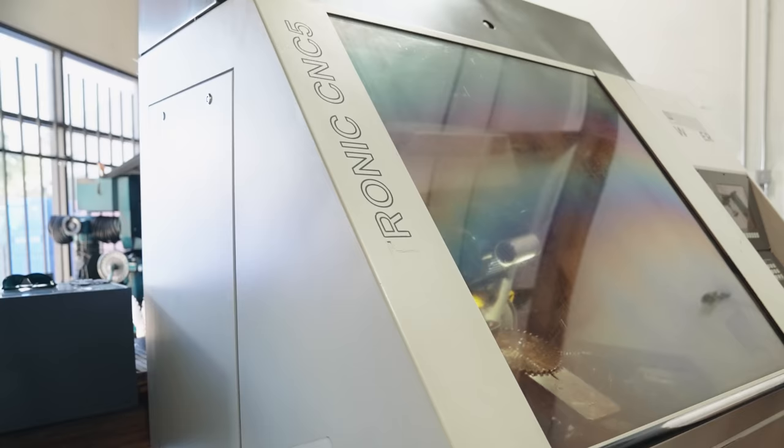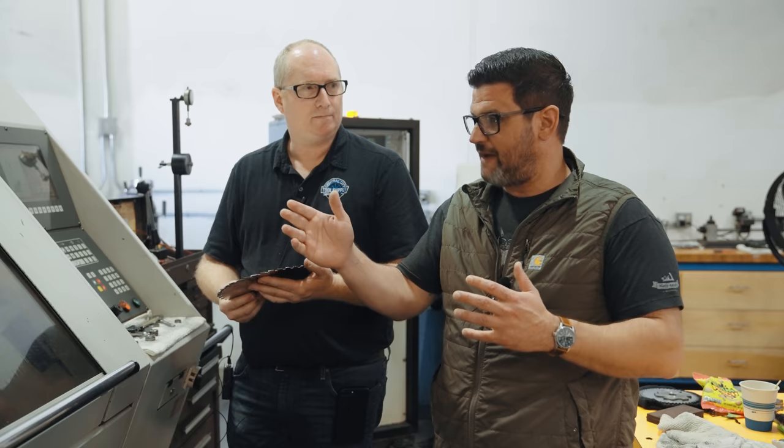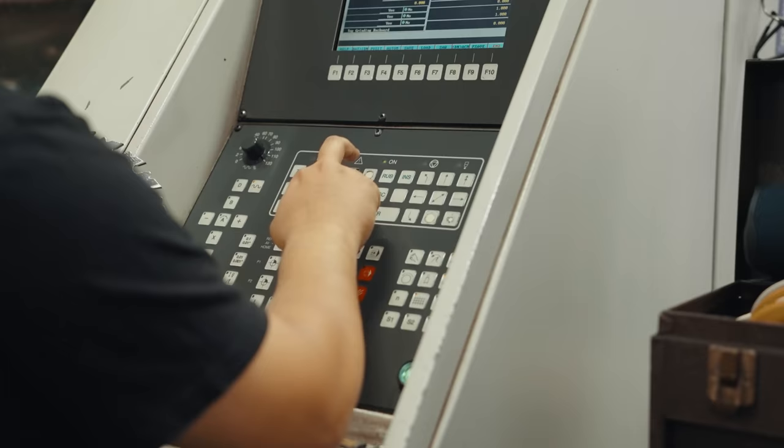Next, we're actually going to sharpen the blade. Mike has one of the coolest machines I think I've ever seen. What is it? A five-axis CNC saw grinder, programmable to rake angle and tooth angle. Not only that, but it can probe the distance between the teeth. And if there's an alternating frequency between them, it can adjust for variable pitch. It has what's known as a smart finger. Let's program this thing and get this saw blade in here.